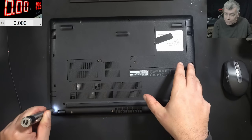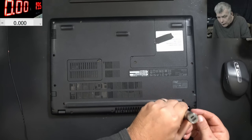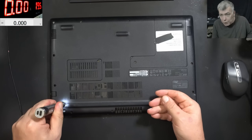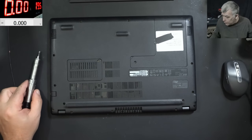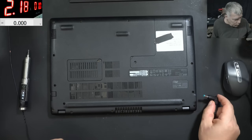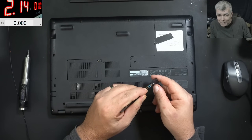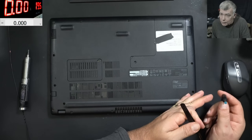That means the short is very near to the charging port. Obviously you lose current on any kind of wire, but especially with tiny wires the voltage drop will be visible. So plugging in the charger we have 1 volt — check that, 0.9 to 1 volt. So basically the short is exactly at the charging port.